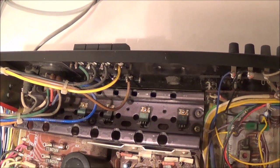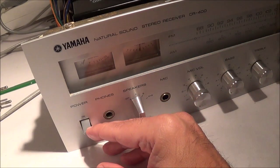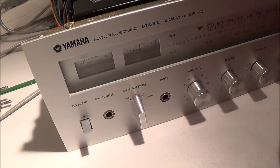As far as the power transistors are concerned, you can see them down there — I think those are TO-220 type transistors, so they're not going to handle that much power. Overall I like this receiver — it's a pretty simple unit. The FM reception when I hooked up a dipole antenna was really good, and I like the sound when I listen to music through it.